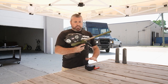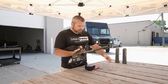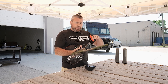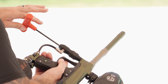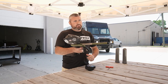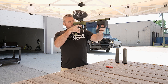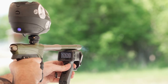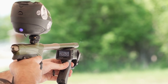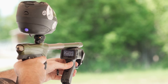So what I'm going to do now is flip the gun — be very careful, don't point the barrel towards your face. Take your 3/16ths and I'm going to do it a quarter turn at a time. A couple of test shots off to the side just to let the regulator reset, and we'll see if it dropped any lower, which it should have. Readings are 253, 263, 248, 263, 259.